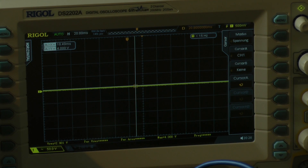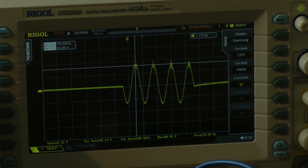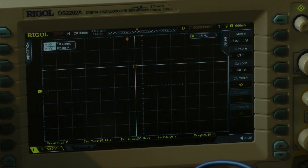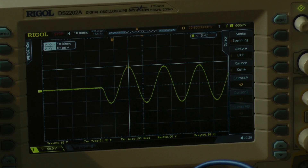And now I start the dynamic power test with 40 hertz and 4 cycles. That's way too much — you get distortion here. I reduce the gain and take another shot. This looks better, as we have 82 volts at 40 hertz.